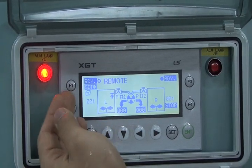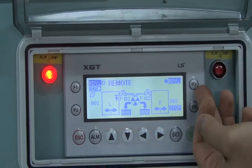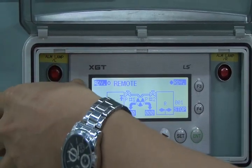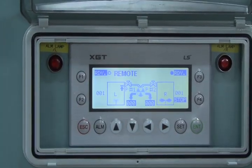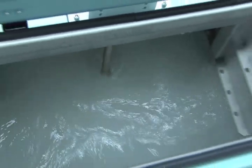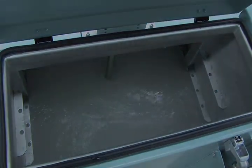Step 3. Press F1 button for the left tank and F3 for the right tank to operate each agitator. The operation of agitator is discontinued after about 15 to 20 minutes. Check RDY on XGT after the agitators are stopped.